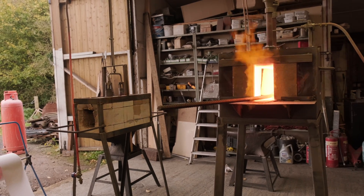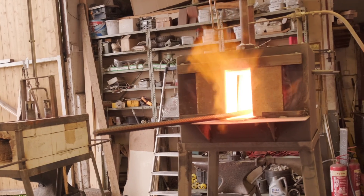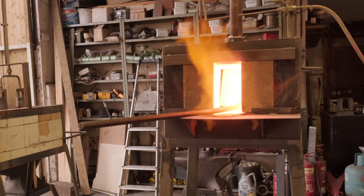Be warned, it takes a long time to get hot because you are running the furnace gas-rich — you're not burning all the gas. What do I mean by gas-rich? A lot of people call it setting your forge up to have dragon's breath, i.e. you've got yellow flames coming out the end of your forge. When those flames go yellow they're actually atoms of carbon which haven't burnt, and they are now burning in the free air as it spews out the end of your forge. That free carbon means there's no oxygen left inside the hot zone of your furnace.